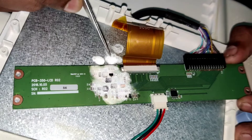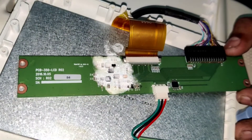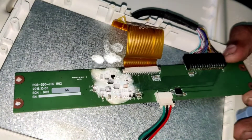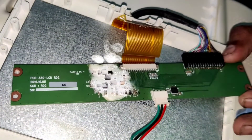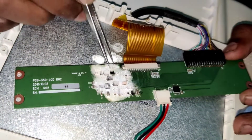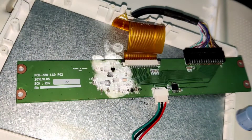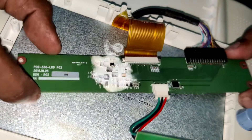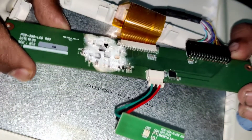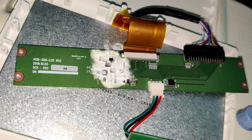I found the heat spot here and the component is a comparator — the comparator is faulty. I have a lot of donor boards but I don't think I have this component because it is a 331, and I have an LY45G comparator. Let me check it again.